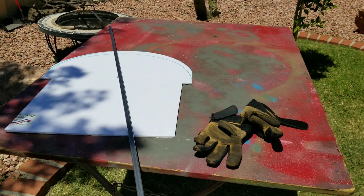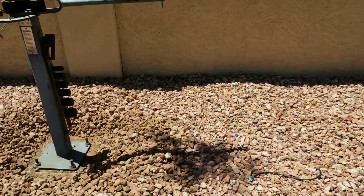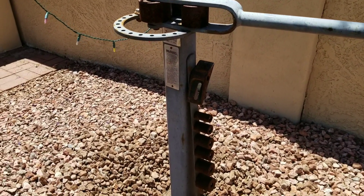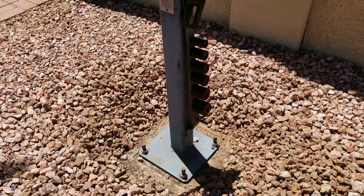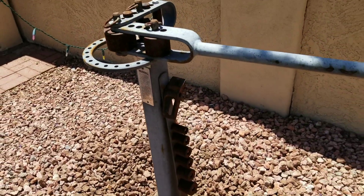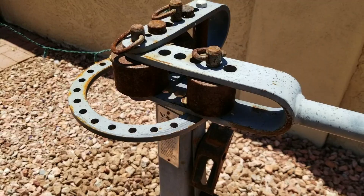I've relocated my workspace to the backyard, brought my little workbench table out here. I marked the center of a 50 inch piece at 25 inches, then marked every inch or so with a little blue mark. Here's my metal bending operation. A couple years ago I got this metal bender secondhand — it has surface rust all over it, so I didn't feel too bad about storing it outside. Upon consultation with the wife, we decided this is a more appropriate place since it's only used once in a while. Most of the time it's unbolted and stored in the corner, and the rocks cover up those little bolts. There's a concrete pad underneath with some big lag bolts so this thing doesn't move around. I've got the biggest diameter pieces on here and we're just going to go around slowly.